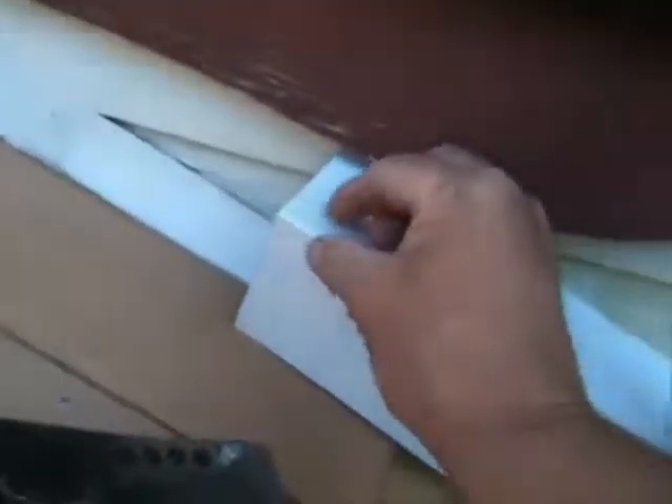On the other side though, I don't have this window sill board, so I will do a little counter flashing like this, with just a cut off on it. I'll cut that into the wood siding slightly, so that it also expels the water and gives a nice paint edge. Step flashing — that's what that's called. You can buy that at your local building store.